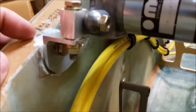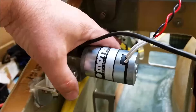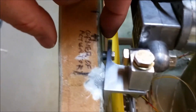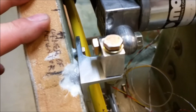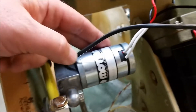The main bracket is attached through this hard point that Marco machined for me, which I had to cut basically in half. Now, to keep this assembly from pivoting forward or backwards when pressure was applied, I had to put this small bolt in. You can see it with that hard point right there — this will all get filled in with foam and flox and a couple plies of glass. So that's this end.